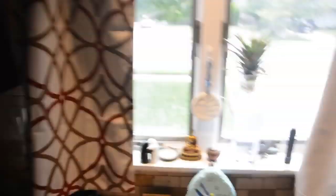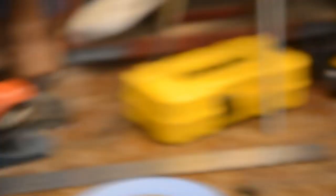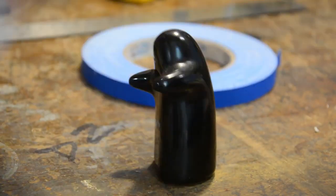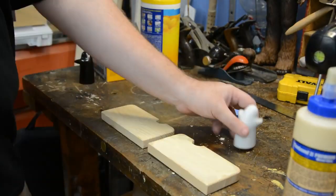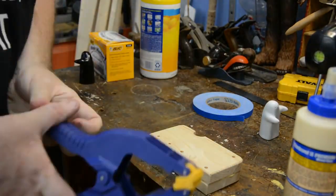The next shop tip deals with gluing wood together. Most of the time when you go to glue two pieces of wood together and put the glue in the center, they slide when you try to clamp them. There's a really, really easy fix for that, but we've got to go to the kitchen first. The answer is salt — regular, stupid iodized table salt. Using it makes just enough friction between the two pieces of wood and the glue that they don't go anywhere.